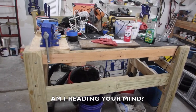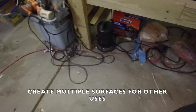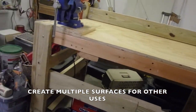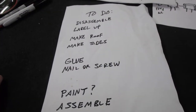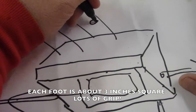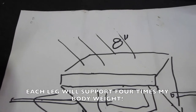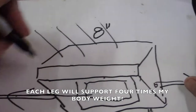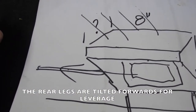You're probably watching this video because you're going to build yourself a work table. Get yourself some paper and figure out how big you're going to make it. Find a space in your garage and see if it'll fit. This work table turned out to be really perfect because I can move it around — when it doesn't fit in one spot, I can move it somewhere else. That's the trick: make stuff mobile. On a lot of workbenches the mobility comes from locking wheels, but I can't stand locking wheels. If you've ever put any leverage on a workbench and the wheels don't have any grip, you know the problem. Build your workbench like mine — it won't move.